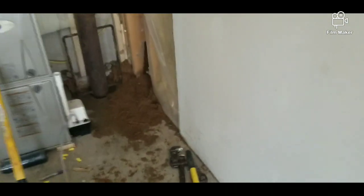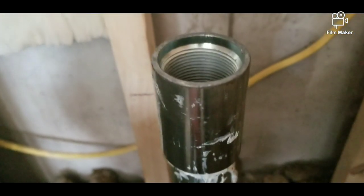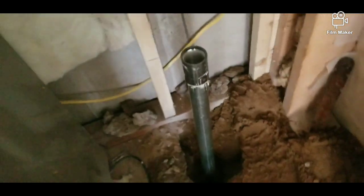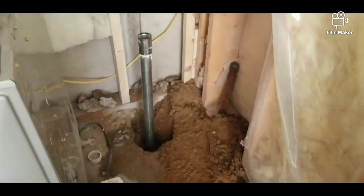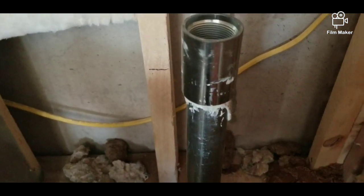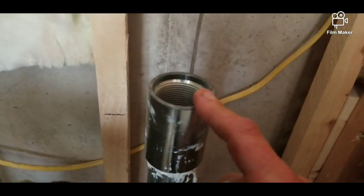Alright, we're going to keep going. We're ready to put another segment of pipe in. As you can see, that's what I'm using for my drive instead of using a cap, which as you saw what happened with the last one — I found these and they're a lot better. Always when putting another pipe on, make sure you really lube her up using this stuff — pipe compound. So we're going to add another pipe. Also, before you start pounding, make sure you tighten this down just in case it has loosened, which is exactly what happened to me on my other well. Tighten this up, add your other pipe, and seriously, tighten it down as hard as you can. Go get your girlfriend if you need help.